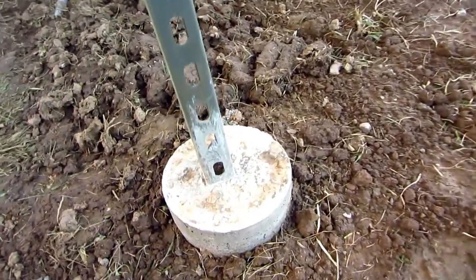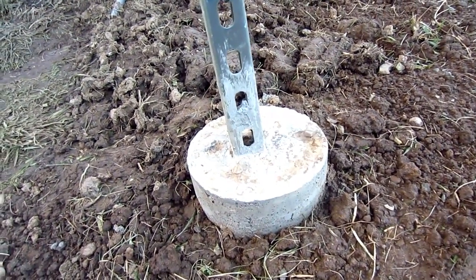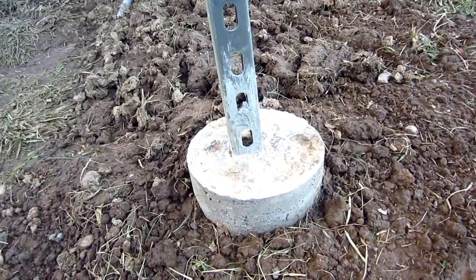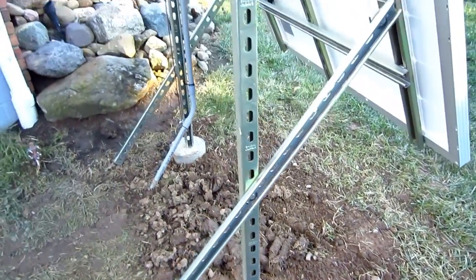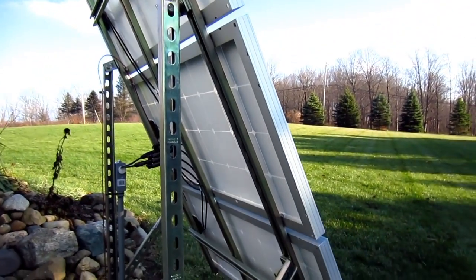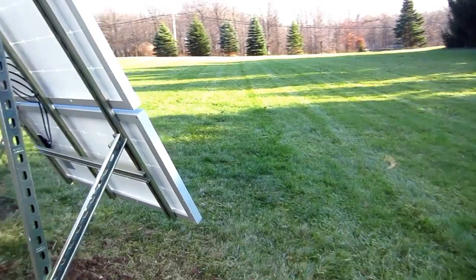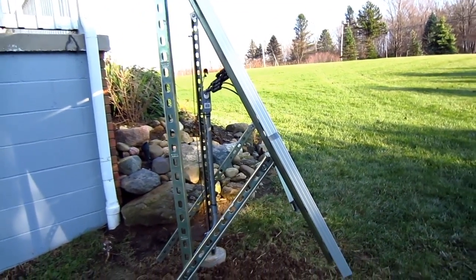These main supports are sunk four feet into the ground. I rented an eight-inch auger, went down, and put those supports in place while I poured concrete into the eight-inch tubes, held in place with other pieces of super strut bolted on the ground. Let that dry a few days and it's pretty solid. This structure is facing due south — I used the solar noon method to achieve that; don't use your cell phone, it won't work. The whole thing is engineered to withstand 90-mile-an-hour winds.